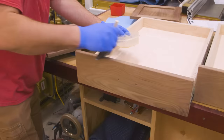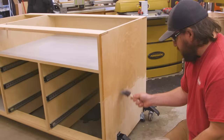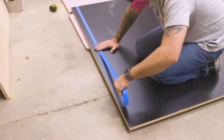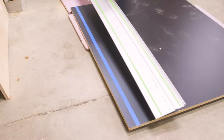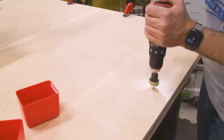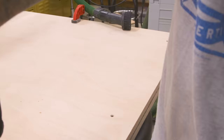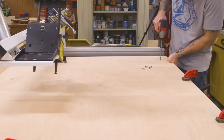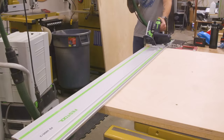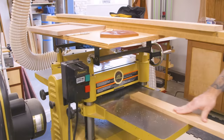John's now adding a little bit of finish to the cabinet. When it comes to shop furniture, really any finish will do — I usually just use whatever I have the most of. Now for the top — it's going to be a double sandwich of three-quarter inch plywood and black melamine. Both pieces are cut slightly oversized. I'll stack the two sheets on the flattest surface in my shop, which is generally my table saw, and pre-drill and countersink for screws. There's no glue between these sheets, so use as many screws as you need to help prevent bowing. Now that the two sheets are stuck together, I'll trim each side slightly to flush everything up and bring the top to final dimension. To protect the edges and make it look nice, I'll add some three-quarter inch solid edge banding with mitered corners.